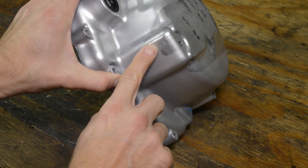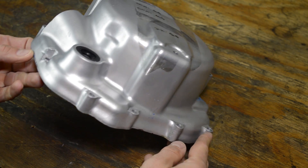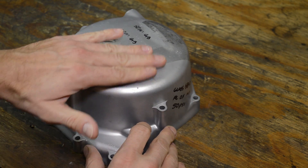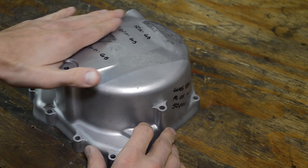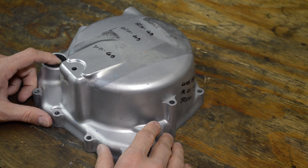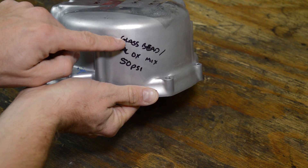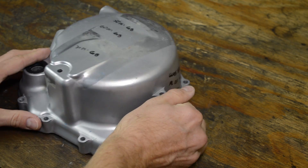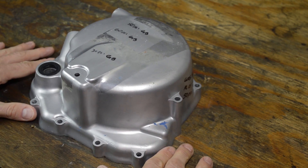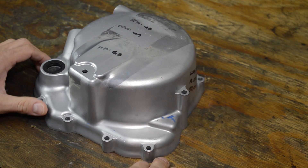What I was after was a faster cleaning process. I'll change the media and go back to polish with just glass beads. There's also some factory clear coat, which is a pain to remove, but this mix removed it no problem. So I'm going to clean all the silicone off — there's a little duct tape residue too and the media doesn't like that. I'll remove the seals, blast the rest with the glass bead and aluminum oxide mix, then tape half of it off and hit it with just glass bead so we can see the two-step process used to get this part looking brand new.